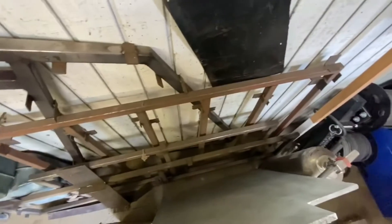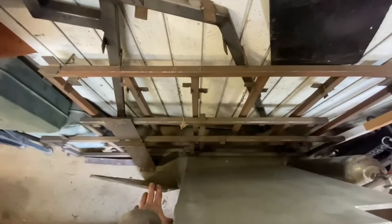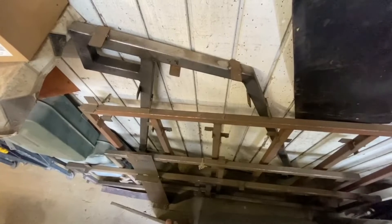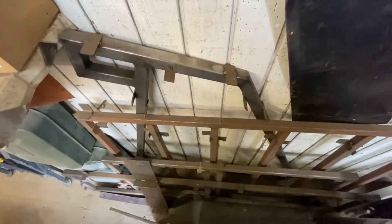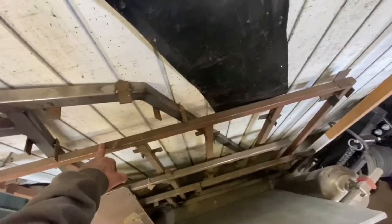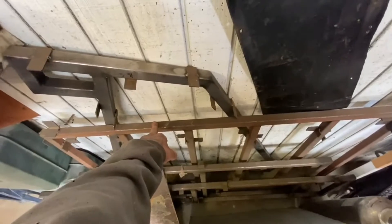So yeah, that's pretty much it. Building a jig is going to save you a lot of time. A lot of people probably already knew about this, but there are going to be some that didn't. It's especially handy when you're doing gate frames and you need two — sometimes I'll just use my main gate frame and jig up the other one if it's going to be a dual gate. Here are some of the other jigs I have: some at the bottom are trailer components, there's part of a handrail for a business that always needs their handrails redone, and this one is a shelving jig for a specific company I did a bunch of shelving for.